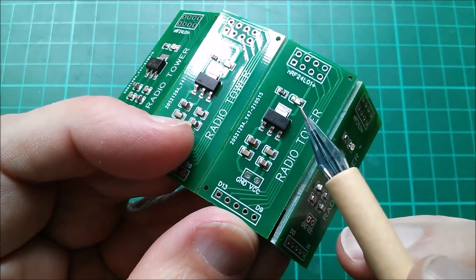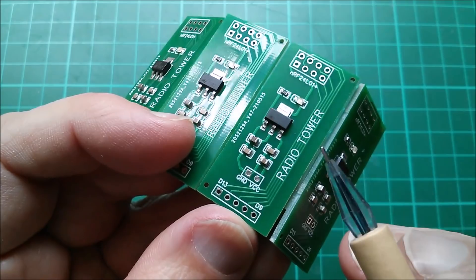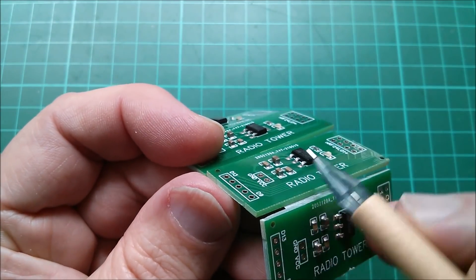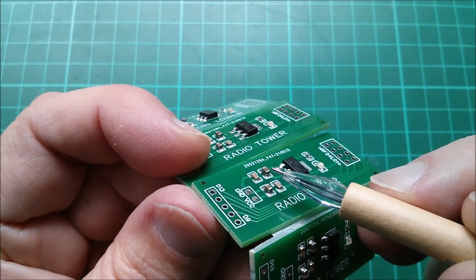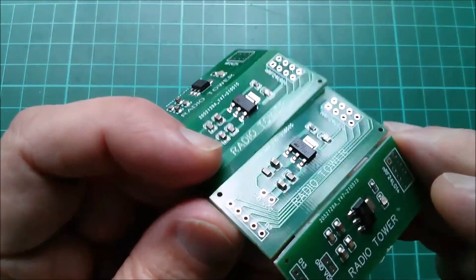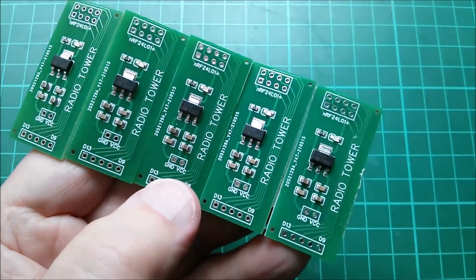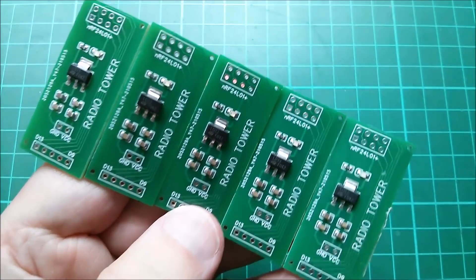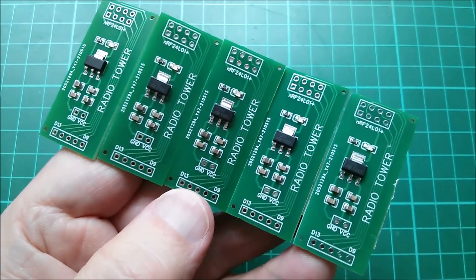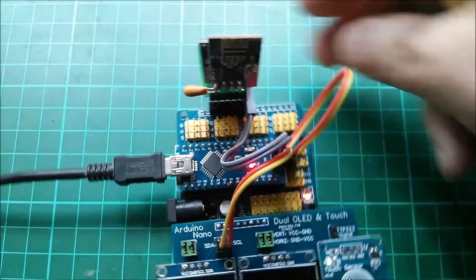We've got an LED and I still don't know the color of this, so we'll find that out today. There's a 1k resistor - you can have a closer look at that in a moment. Capacitors of course - these aren't marked, but we can see by their varying heights: that's surely the 10 microfarad, this must be the 100n, and these must be the 10n. And that's it - that's all that's on there. This is the connector, and I've just received a 4x2 connector for that.